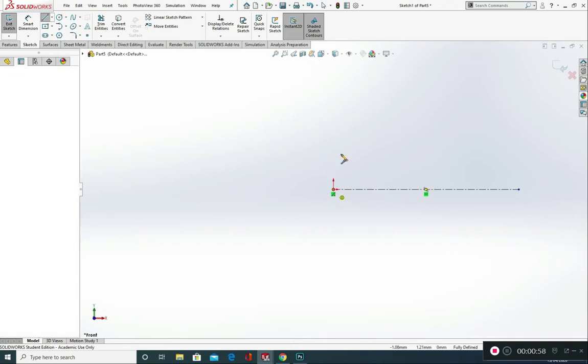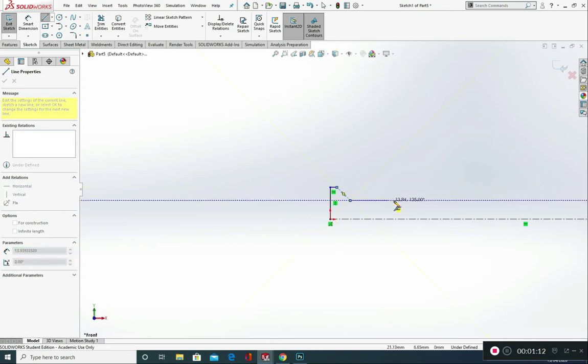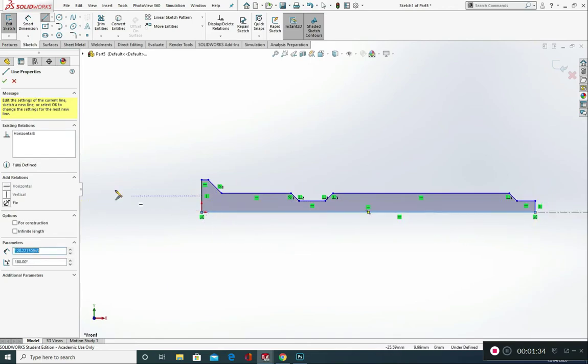Your profile should look similar to mine when you're finished on the screen. I'm not being too precious about these dimensions at this moment in time — I'm just trying to get the scale roughly right. Going across, back down, across, back to the centre line and back to the origin, back to your start point. You know it's a completed sketch because the inside will turn purple.